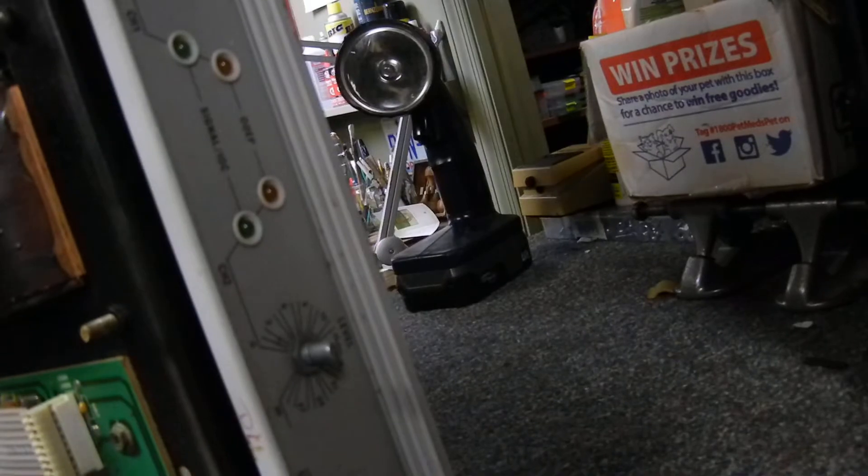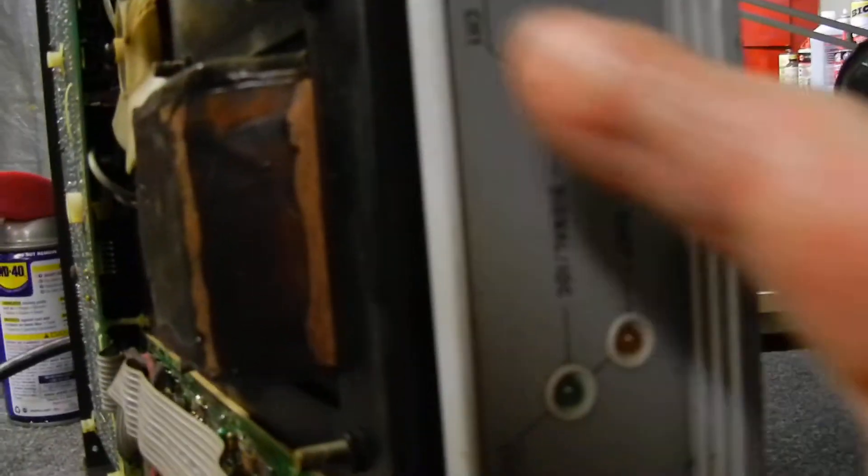Whenever the amp is running, it's in ODEP mode on the front — you've got green lights and red lights. I looked it up on the Crown website: ODEP stands for Output Device Emulation Protection, which is a thermal protection mode. It's an analog computer-modeled circuit that reads the temperature, and if the circuitry isn't cool enough, it limits the output stage to keep it from overheating. It's running in that mode obviously because the fan wasn't spinning and it was running hot.